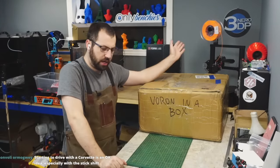So here's the thing when it comes to the extrusions. It's okay if they're not exactly to spec, okay? So if you need 300 millimeters of extrusion and it's 299, as long as all the ones that are supposed to be 300 are all 299, you're okay. You run into issues when they're all over the place, because you can't square stuff up easily. Now, obviously, checking with the tape measure isn't full on proper measuring, but it's what I got.